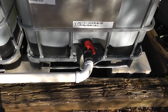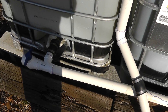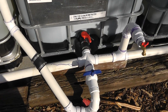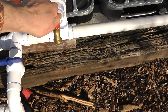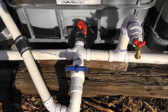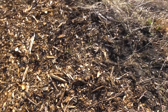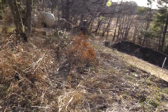This is simply plumbed down here — all the tanks are plumbed together. There's a spout to another garden that we haven't hooked up yet, and it's turned off. All the tanks are linked together, and there's a downspout for watering the garden here. Then there's a spout which actually runs down into some poly tube out to the soil system which is out here.